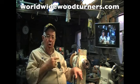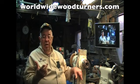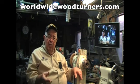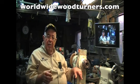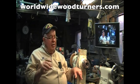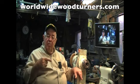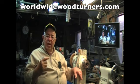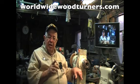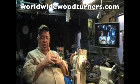What it doesn't do is hurt your chuck or your Morse taper because, see, when my buddy, who's remaining anonymous, takes his out, he has to go take a hard look at it now to make sure that he didn't put some lands or some grooves on it. Lands or ridges, maybe. But if it moved, he's going to get that off, or it's going to bite into his headstock and mess up his headstock. So you see, it is a real careful connection.